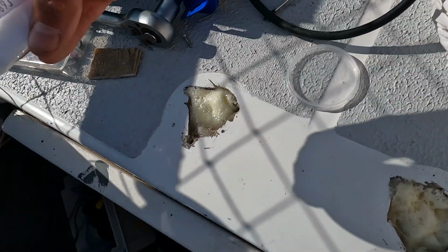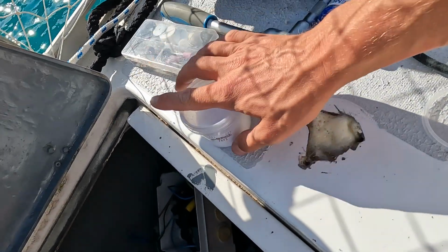So this is my thickened epoxy, which has been filled with some of the colloidal silica stuff, but also lots of chopped up pieces of fiberglass sheet. I was really worried about the epoxy not curing in time for the evening or overnight dew, and well, I kind of messed up in that sense, because the epoxy has cured unbelievably quick because of the sunlight that is still shining, beating down on us, even though it's 6:10 in the evening.